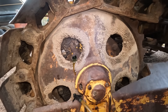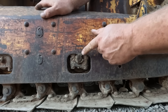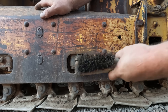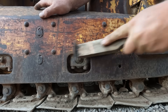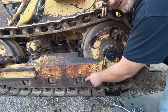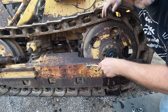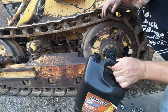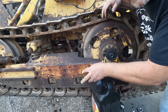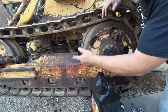That final drive was pretty close to full already — nice. There's supposed to be a button-head grease fitting there. Found it. I need to get lube into those bottom rollers through these button-head fittings using a button-head fitting adapter on a grease gun. Problem is, I'm not supposed to put grease in there — I'm supposed to use the same 90-weight GL1 gear oil that goes into the transmission, because grease doesn't actually circulate properly and can destroy the rollers.